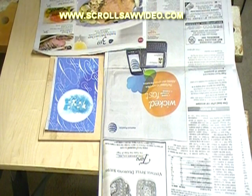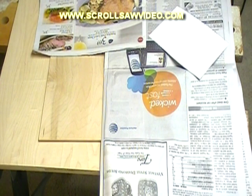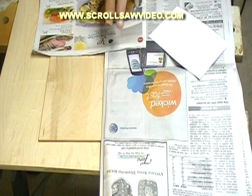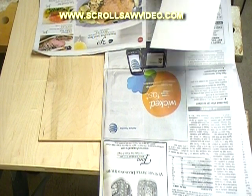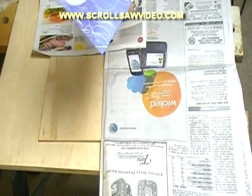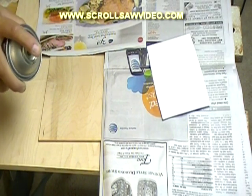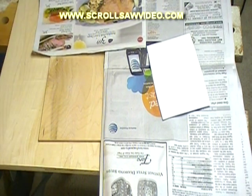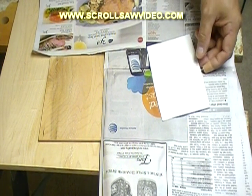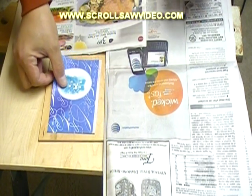The reason I am using the newspaper: when I pick up my card, my piece of plywood is very large for this piece. Instead of cutting down the whole piece of wood, I just cover it up with newspaper. Most scroll saw patterns you will spray the back of the pattern and stick it to the wood, but when you are doing jigsaw puzzles you want to directly spray the glue on the wood itself. A nice good coat.